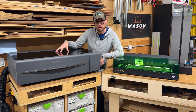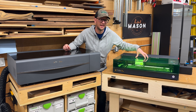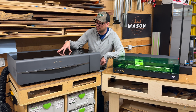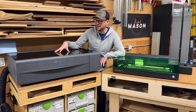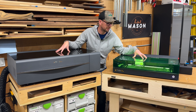The 55-watt CO2 laser is a totally different laser technology than the diode, so it has some different capabilities. It can cut clear acrylic — really thick clear acrylic — and it can etch clear acrylic, whereas the S1 really can't touch clear acrylic. It can work with opaque and mostly opaque acrylic. The 55-watt CO2 is going to give you the most material flexibility; you're going to be able to cut much thicker material and engrave and cut much faster than the S1.